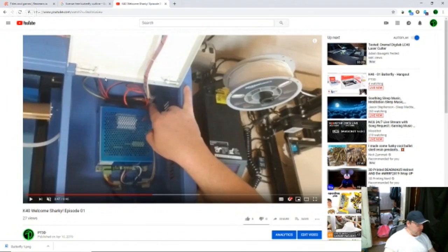have you looked at the laser tube? Is there any air in it at all? Because the easiest way I've found to burp the laser tube is to tilt the machine, so basically the left side of the machine I'll tilt up about 4 to 6 inches, and then I pinch the supply line from the pump, the short tube next to the laser tube, and hold it for a second while it's pumping, and then while it's tilted, I let go. I'll lean it to the left, and then to the right again, and then that bubble travels up through.